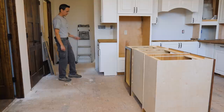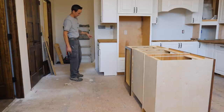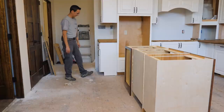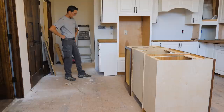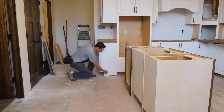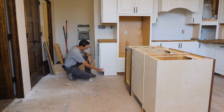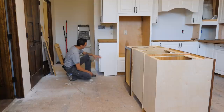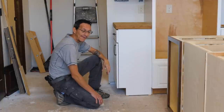So I can either trim it out with baseboard or modify this cabinet. I've been thinking about it all night and I'm leaning towards cutting it off, moving it back, and basically making two toe kicks so that when we trim it, it'll look right and match everything else. The problem is it's already screwed in, caulked, sealed, and there are no gaps — it's kind of perfect. But I've spent so much time trying to make this whole thing perfect — it doesn't make sense to mess it up now. I think I'm going to pull this cabinet and cut it.